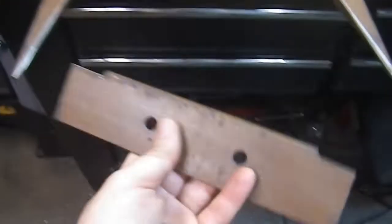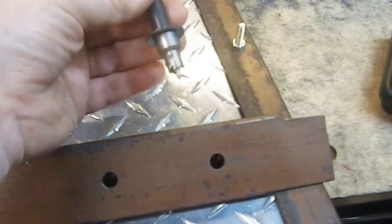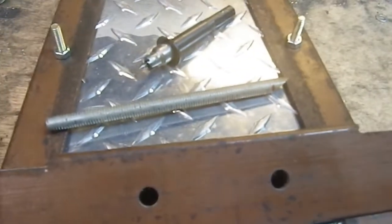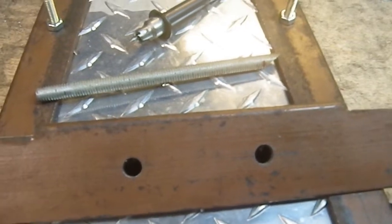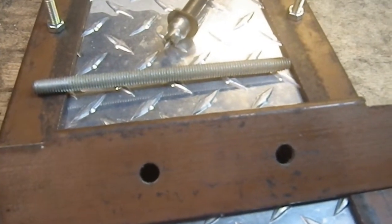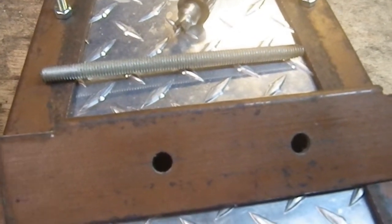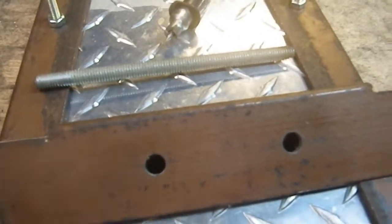So I put the two forward holes in here for the points, and I used one of my Blair Rotobroach bits to do that, and I'm going to be using this piece of threaded rod to make the points. I haven't quite figured out how long they're going to be yet. I'm thinking probably 2 to 2.25 inches long. The nice thing I like about the threaded rod, as opposed to using a bolt, which has a head on the end, which is kind of convenient, is that I can put this into a drill, put my angle grinder in my vise, spin it, and then spin this in the drill, and it makes a really nice conical point